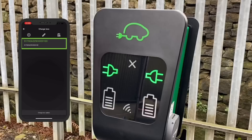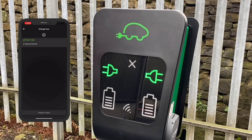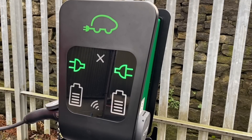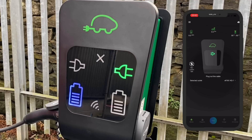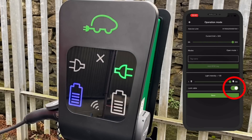There is an app, and it's incredibly easy. After downloading the Taking Charge app, it's really easy to add a charger to it - you just look on the back of the charger near the ethernet port, find the App ID, and put that in. You may also want to give it a friendly name so you can remember which charge point you're at, particularly if there are a lot of them in a car park next to each other. We're going to call ours eFIX HQ - done, charger added to the app. So let's see how the charger and the app work together. I've plugged in a car to charge, we're watching for the blue battery symbol to flash to confirm charging has commenced, and we can now see that in the app.